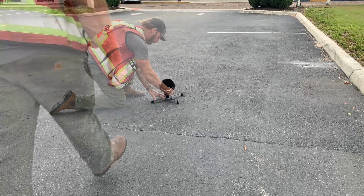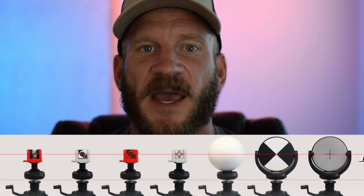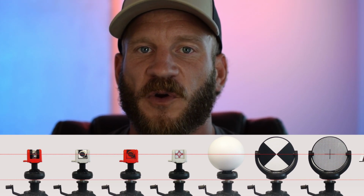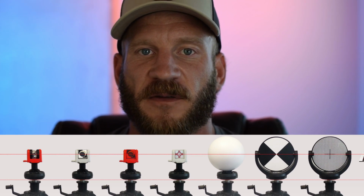Not only is your accuracy going to be far superior because the scan target is falling exactly on the same mounting point as the prism that was used to tie it in, basically giving us an HT of 0, but I'm also not having to set and leave a ton of concrete nails or permanent marks all over the place that some clients do not care for.